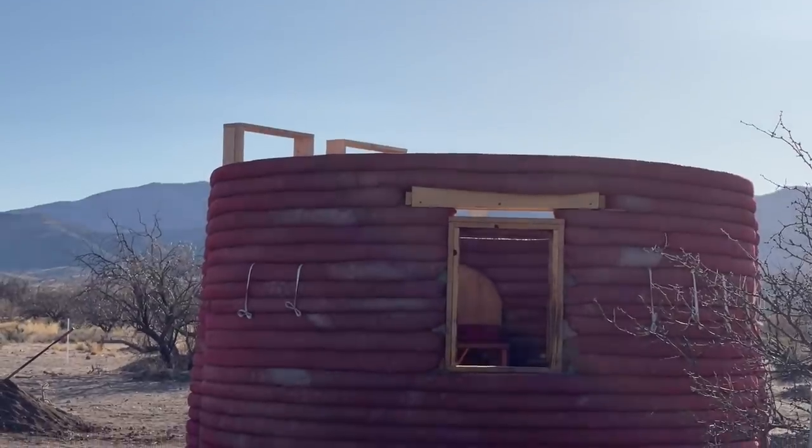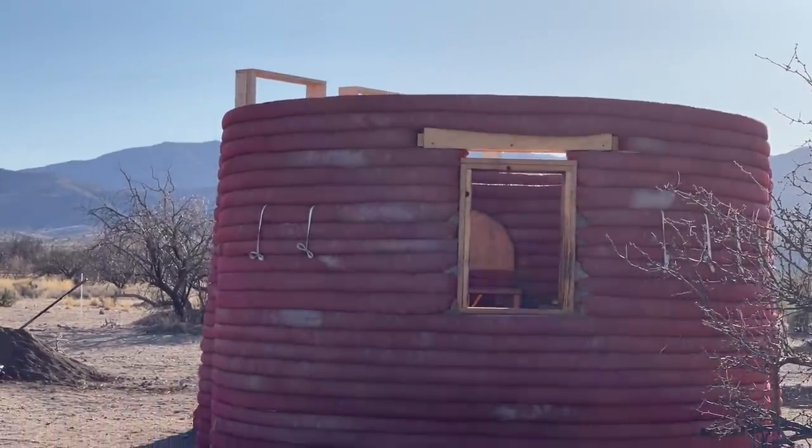Maybe we should talk about our big plan change. I think every day we're just going to say, today plans changed. Our original plan was a 4x6 on the front, a 4x6 on the back, and two LVLs sandwiched together in the middle. But we were worried that the back corner with the 4x6s would need a post right there, which wouldn't have been a huge deal, except we put the window exactly where the post would be. It would have been perfectly in the center of that window.